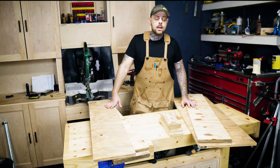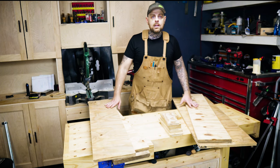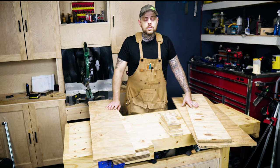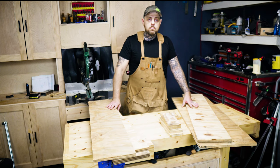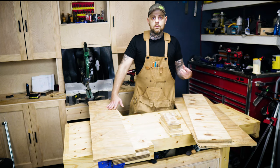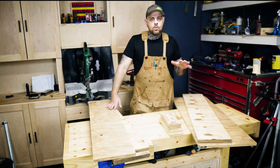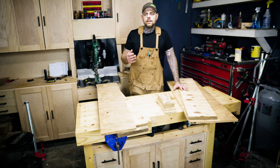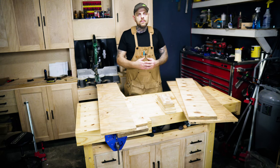And I was right, these sell really good. I've probably sold about 50 of these. I actually just make them out of 3/4 inch regular plywood that you can get from any of your big box stores. If you were doing this for yourself, then I would recommend that you probably use birch wood, which is a hardwood, a better wood, and an easier wood to work with. With the price difference, it's about $20 to $25. And it's actually probably worth it for me just to spend the extra money, because the time that I spend sanding, trying to straighten this wood out, it'll probably even out in the end.